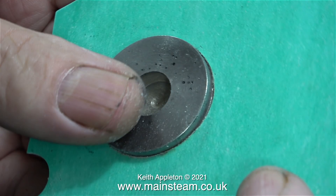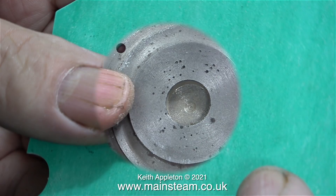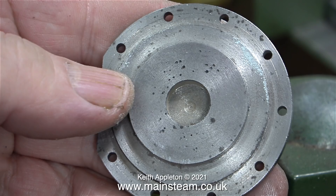As you can see, it's quite a good fit on the centre register, but there is a slight problem — I don't mean the blowholes in the casting, they're not terribly important because most of them are on the inside. The problem is I've done something wrong: I've used the centre part of the cylinder cover to make the impression on the gasket material, and it was impossible to use the ink pad method for the real register that goes down inside the cylinder. Why does this cylinder cover have quite a large piece that protrudes down into the cylinder? Is it to even up the exhaust beats? Because at the other side of the piston there is a piston rod which decreases the volume in the cylinder underneath the piston — so is this protrusion on the cylinder cover to reduce the volume in the upper part of the cylinder?